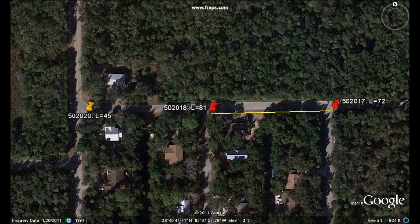Knowing the material, size and length of pipe between loggers — in this case 326 feet of two-inch galvanized steel — we were able to determine a leak position through correlation data.